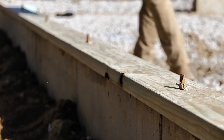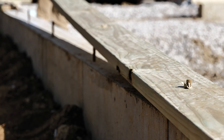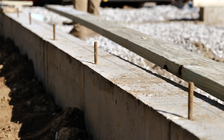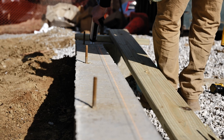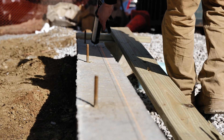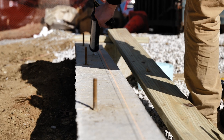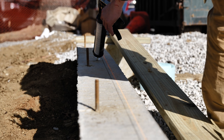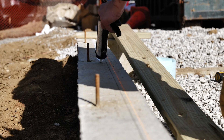What we're talking about here is how our air barrier is continuous from our foundation wall up through our floor system. The first thing we're looking at is how we transfer the air barrier from the foundation wall — the actual concrete being the air barrier — to the mud sill, which is what our floor system or wall system will be sitting on.